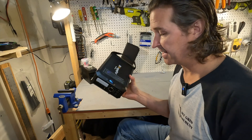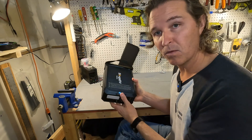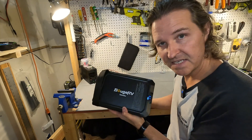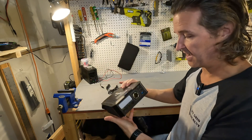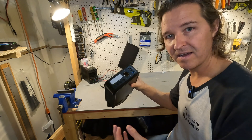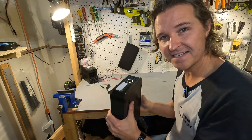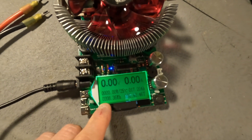I'm going to plug this in, make sure it's at 100%, and then do a DC capacity test to see the actual capacity. This unit is marketed at 240 watt hours. These may be regulated so capacity may be about 10% less — we might get around 216 watt hours, but let's test it. The DC capacity test is done and the result showed 208.36 watt hours, which is pretty respectable. Out of 240 watt hours that gives us an efficiency of about 87%.